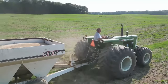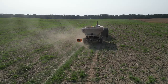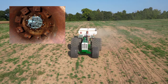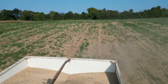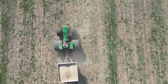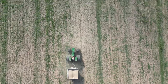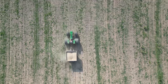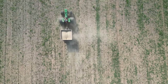I'm not sure how that would work. A 220 should be big enough to handle the stress of a Terra tire, depending on how much they're bouncing around and how much weight they have on the back. The 1650, I'm sure, would be a smaller diameter axle. But one way or another, they had all these pieces of flat steel, like half inch flat steel. They must have put the hub on the axle and then cut, drill a hole in this piece of steel and then mount it in there and then weld it on. And then that way they knew it was centered up, but it was a hodgepodge.